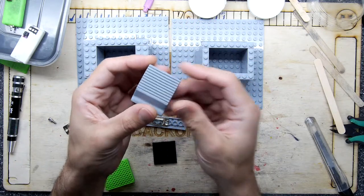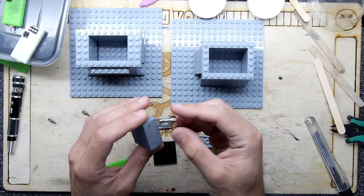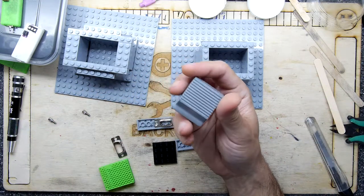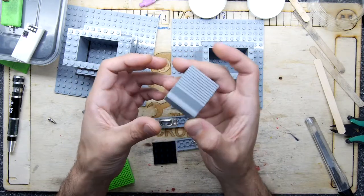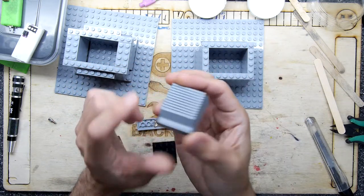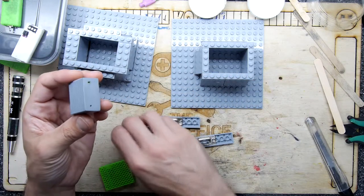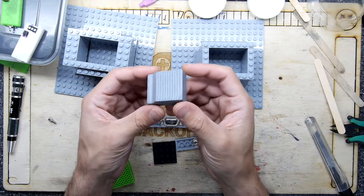So what I'm going to do is make a silicone mould of this now using my little jigs. I've got some jigs here I've made, and they pretty much marry the exact form of the product. I'm going to put it all together and mix up some silicone and show you. It's a pretty simple process. And then after that silicone's set in 24 hours, I'll be able to take a resin cast of this that I can then hand finish better, because resin is far more stable than PLA from a 3D printer. So that's what I'm gonna do. First things first, I just have to clean this up a little bit and attach this part. I'm not gonna bore you with that. I'm gonna go do that, and then we'll go straight into mixing up the silicone.